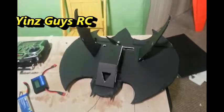It looks like Sunday is going to be the day for our maiden flight. If you saw in the beginning the thing looked a little bit warped and some of the paper looked like it was bubbling after being clear-coated. What I'm going to do is take a big brass tube and shove it through the foam, take it out, and glue in a carbon fiber spar to straighten everything out and keep it nice and stiff. Thanks for watching and until I see you again, keep them flying.